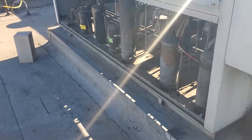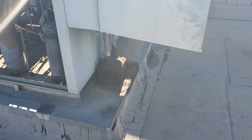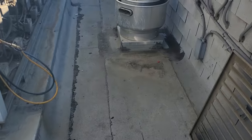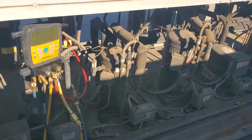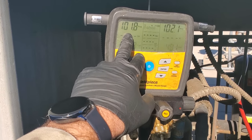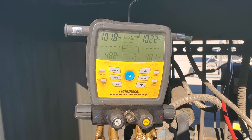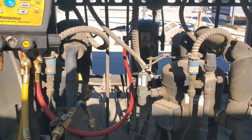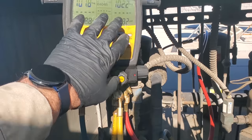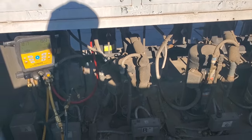Another thing I wanted to point out — you saw pretty big bubbles coming out of that evaporator coil, but I had the system pressures equalized. It's not going to typically have 100 PSI suction pressure — you're typically going to have about 30 PSI suction pressure. So it won't be leaking out as fast, because we had higher pressure creating a pressure differential pushing the gas out of those leaks faster right now. Let's pump it down and see where the liquid level is.